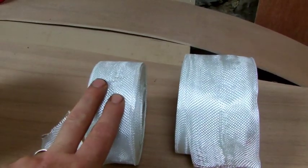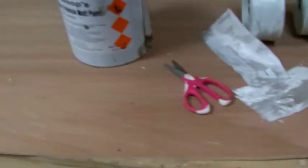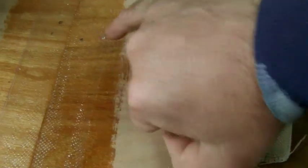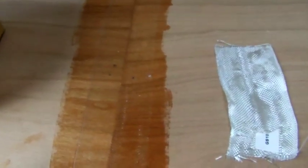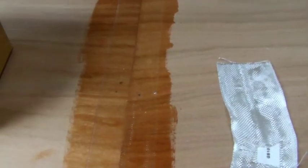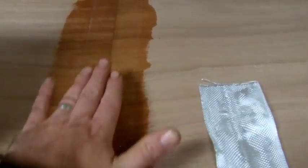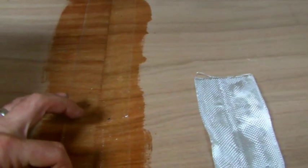You may notice a slight texture to this tape because it's woven. When you actually wet it out, the outer edge protrudes and swells a tiny bit. So once it's all gone off and the canoe is all stitched together and complete, you only need to feather it in by sanding lightly — just around a quarter of an inch along that edge to smooth it out.